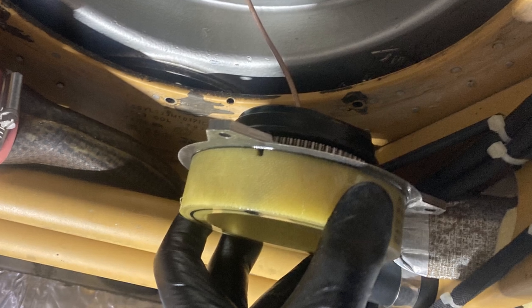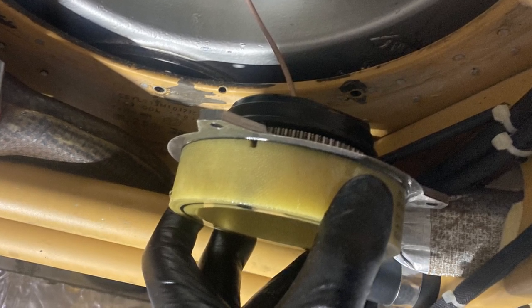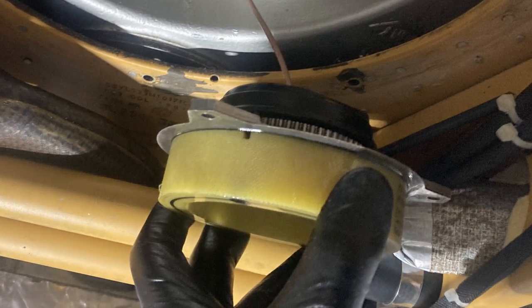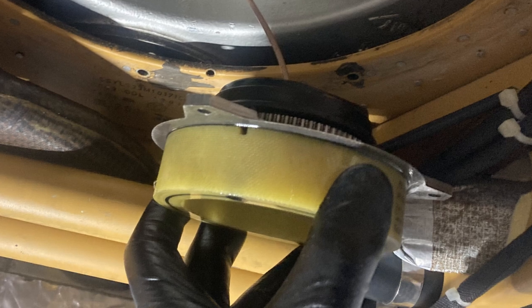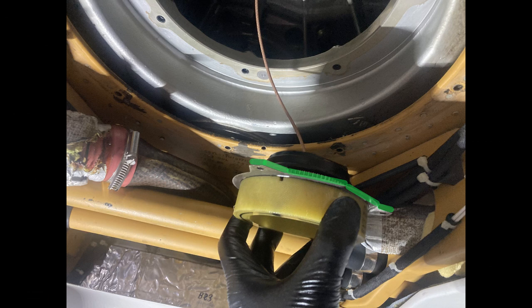All right. It says carefully withdraw the antenna cable slightly from the main rotor hub shaft, but it'll dangle there. Just tie it off. You don't want to let it dangle, but you can get to all the pre-tensioning bolts of the mast nut with that all attached. Just tie it off with a safety wire or something to one of the holes. Not a big deal. Pull the retaining ring 21 together with the main rotor hub shaft seal, the bolt retaining sheet, and the rotor antenna out of the splines of the main rotor hub shaft. Pay attention to the antenna cable.